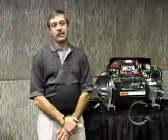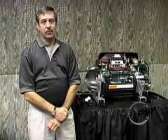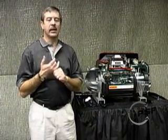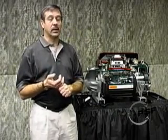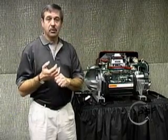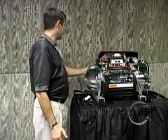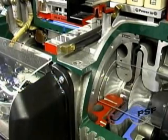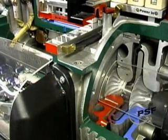The fourth advantage we should talk about is sound and vibration. As we mentioned, the shaft is free-floating in a magnetic field, and the VFD controls the speed. These two components alone allow the TurboCore compressor to run at an extremely quiet sound of only 77 decibels, compared to a screw compressor which can run as much as 90 decibels. Because it is decoupled from any internal components, there's no vibration. Let me demonstrate what the TurboCore sounds like running at 77 decibels. We can actually carry on a normal conversation with the TurboCore running in the background.